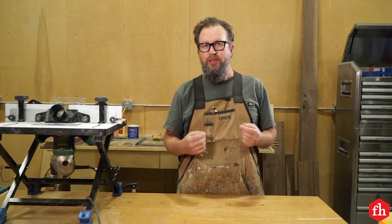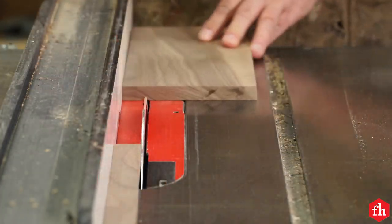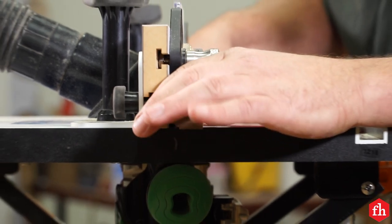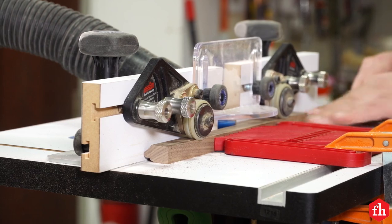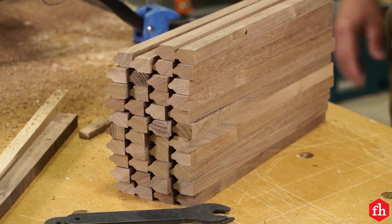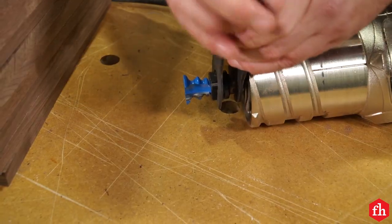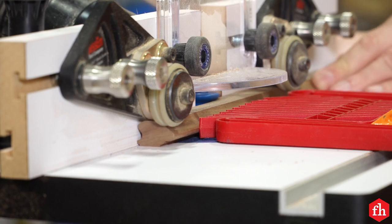Now we're going to start making the actual tambours. I planed a bunch of stock down to five-eighths inch thick and I'm going to rip it into strips that are one inch wide, then run it through the router to shape the edges. Set up the first router bit to cut the convex side of the tambour. Use feather boards or stock guides on the table and fence to ensure consistency and safety. Run all the blanks through to shape the first side, then set up the second bit to cut the concave side of the tambours and run all the blanks through. For the finger-pull tambours and the last tambours on each panel, leave the outer edges unshaped.